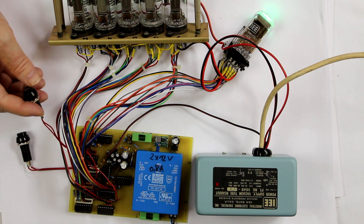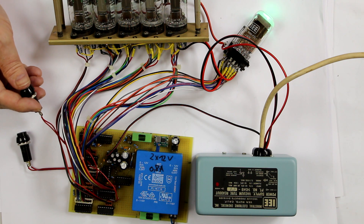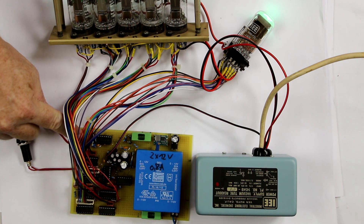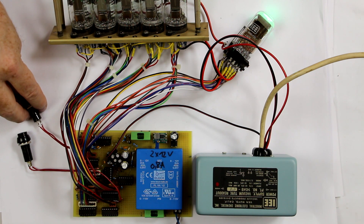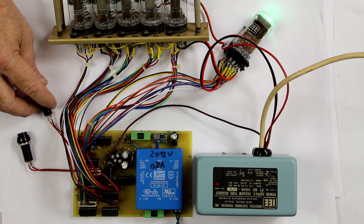The setting is done by a wired-OR connection from, I think, 2 or 5 Hertz from the divider, which divides from a 100 Hertz main frequency down to 1 Hertz, and I've simply tapped off the 2 or 4 Hertz connection.